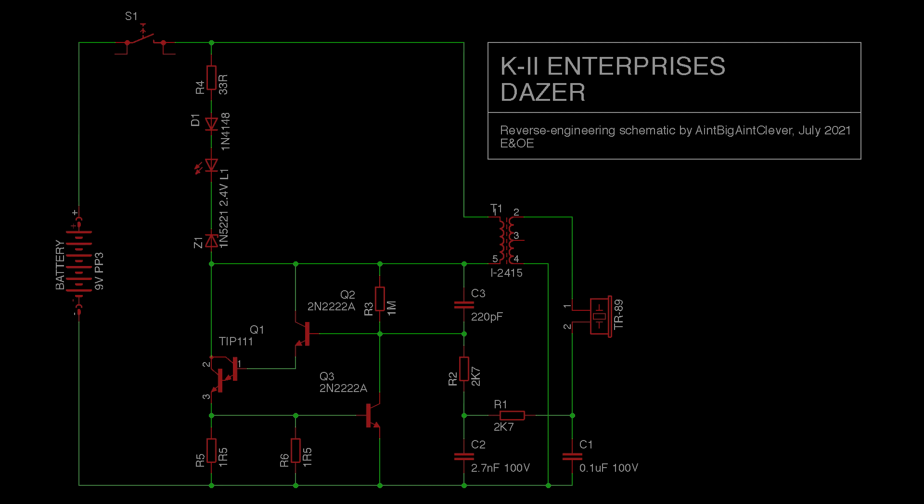So here's the schematic. We'll look at the basic oscillator first. It's a fairly straightforward three transistor oscillator. Ignoring the capacitors for a second, we'll take a look at Q2. If the input of Q2 is high, it turns on and brings the base of Q1 high. If that's on, that brings the base of Q3 high and turns that on, which shunts down the base of Q2, turning it off. If that turns off, Q1 turns off, Q3 is allowed to turn off, Q2 is allowed to turn back on again. And around and around we go.